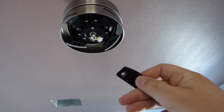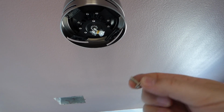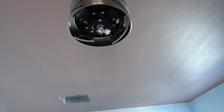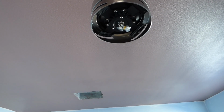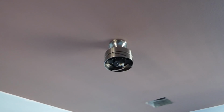In said 3 holes, you're gonna have the fan blade first, then you're gonna have this here armor bracket, see, piece of metal, and to hold that on, you'll have 3 of these here. These screws with the little fiber washer already. They're from this sack here, okay? So now, I'm going to try to show this once and see if we can get it.